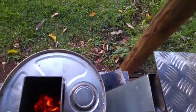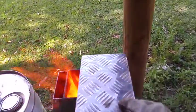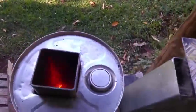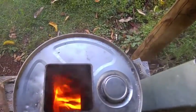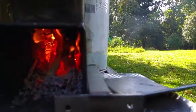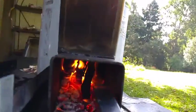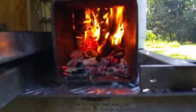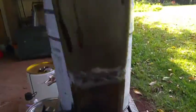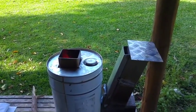I'll just show you what happens. We've got a good rocket happening. I just pull the plate off here - immediately get reverse rocketing happening up here. Cover that up and it burns nicely over here. This is with the back ashtray open. You can see again we're down to red embers. A little jiggle, get some fresh wood down. Very much likes that - that's probably the best burn I've had yet.